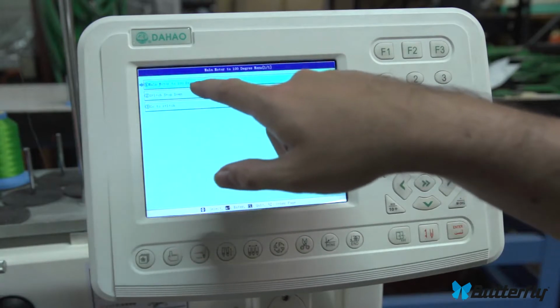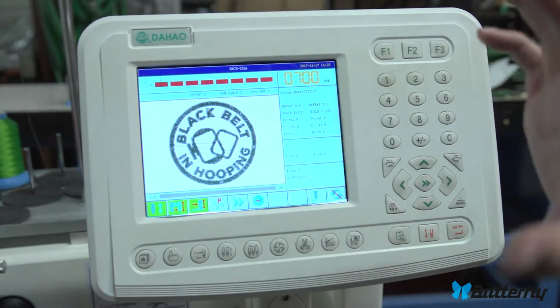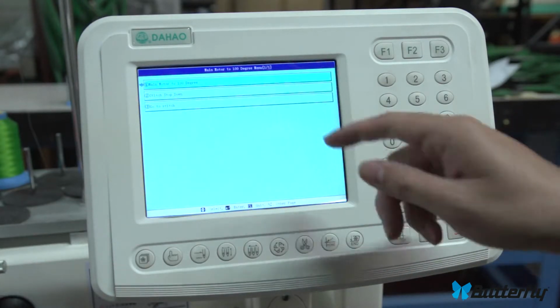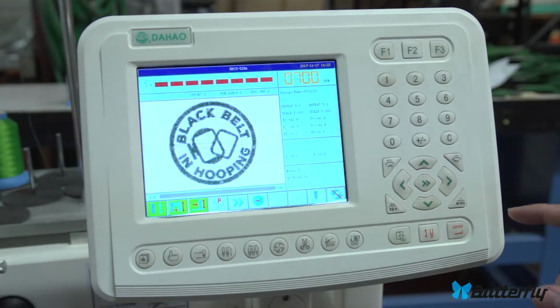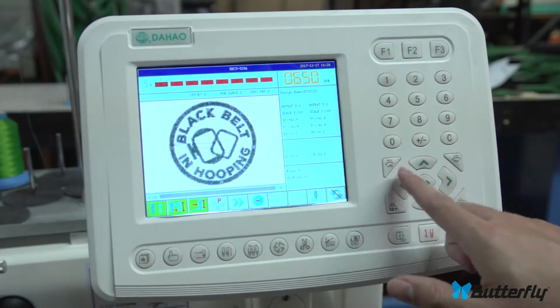Okay, moving up, this dot here returns the main shaft to origin, main motor back to 100 degrees. You'll be using that a lot if you move the machine around, or if it's knocked off of 100 degrees for some reason, or if a technician is working on it. Technicians will really be using that a lot.